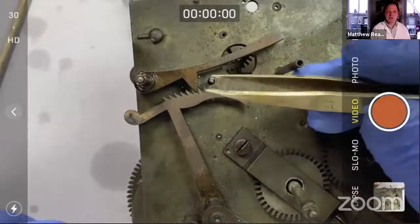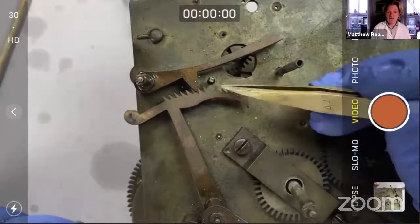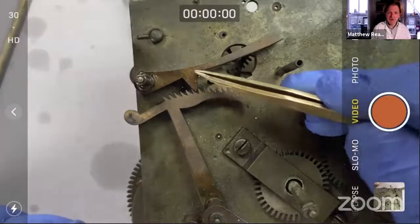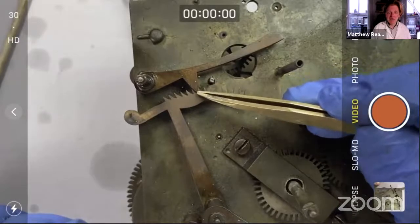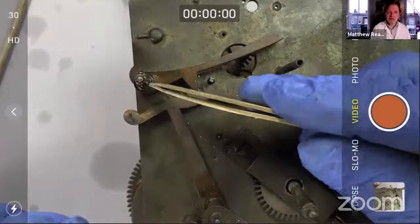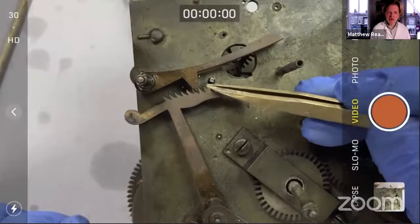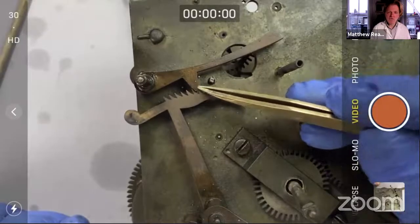So I suppose the question is, what do you do with that if it wears to the degree that in fact it's not gathering properly? Well, I would say again, the answer probably is some kind of filling of that wear or refacing, because you want to maintain this radius. That's really important here. So I imagine what you would do is to reface that.